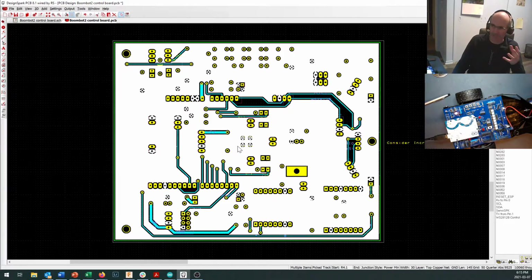Now, one thing that this also does, because remember, if something's electrically conductive, there's a good chance it's also thermally conductive, and we know copper is both electrically and thermally conductive, is that if you have to desolder a pin right here, and this has a really good solid connection to this big ground plane, you have to put more heat into that to get the solder to melt. It's one of the things about working with big ground planes and through-hole plated boards is that the solder gets right inside all the way through, and you've got to heat up the copper on both sides of the board, including the copper right around the big ground plane right here, and it can make it challenging sometimes to try and use the solder sucker to pop things out from your board.